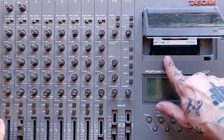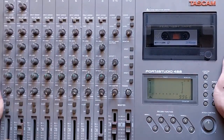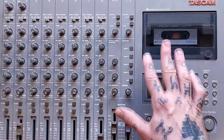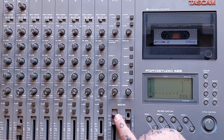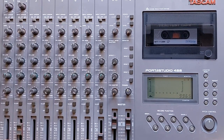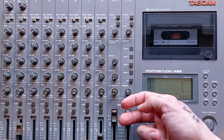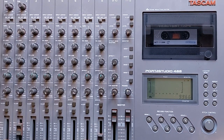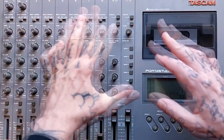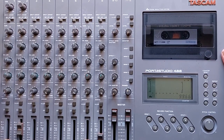That's because the case is warped in some way, and there's a certain amount of pressing on the case, tightening of screws, and loosening of other screws that you have to do to get this to work properly. I also initially thought faders were eroded and switches needed cleaning, but it's actually turned out to be that pressure on the group faders is cracking solder underneath, and pressure on the play button is cracking the solder underneath. Introducing fresh solder and adjusting the screws holding the two halves of the case together would have fixed the issue.